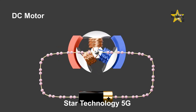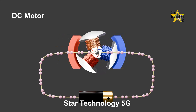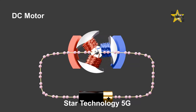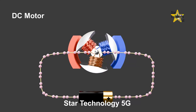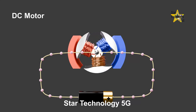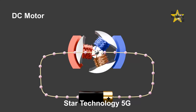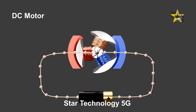If we connect the battery to the DC motor, electricity can then flow through a terminal, through the arm, into the brush, through a commutator segment, into a coil, then out to another commutator segment, into the opposite brush and arm, and back to the other terminal. This generates a magnetic flux into the coils. This magnetic flux forces the coils to rotate due to an external magnetic field.